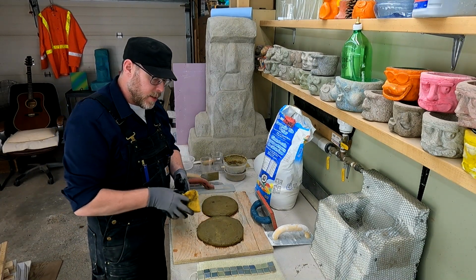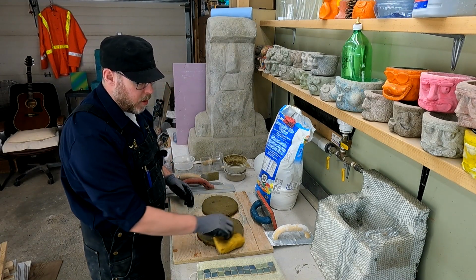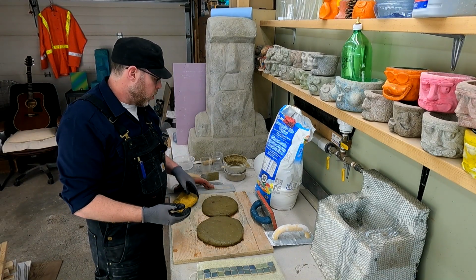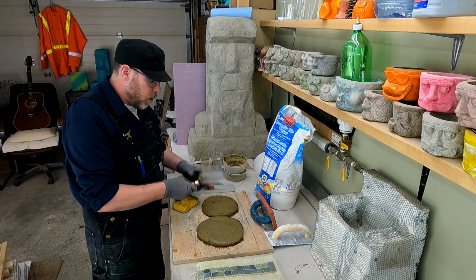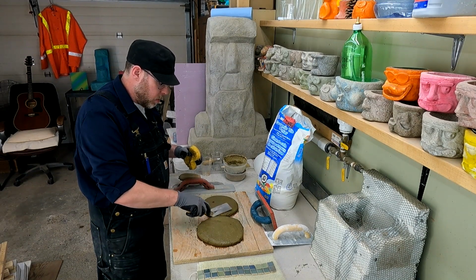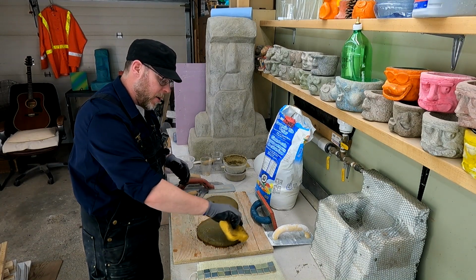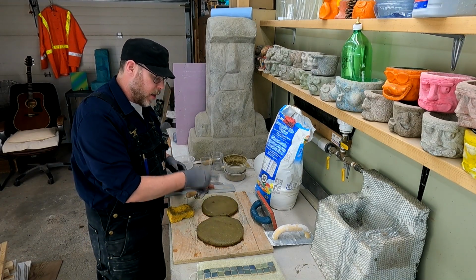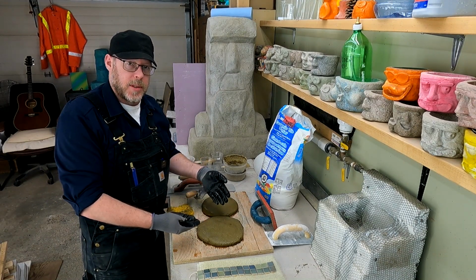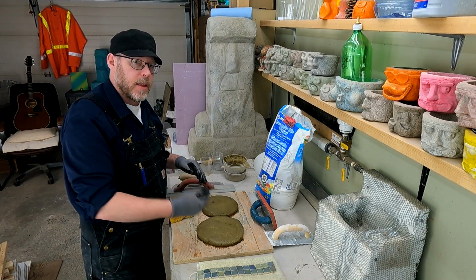The sponge float, as I said, even just a damp sponge itself, especially if we're not really worried about trying to smooth out any errors in the actual trowel or workmanship itself. If we're just trying to arrive at some sort of finished profile, which makes sense for attaching tile to, you would have far, far better adhesion to this one here than you would to this one. And all I would do at this point is I would let my substrate cure, dry. 3 days approximately is the minimum amount before I'm going to take the next step here.